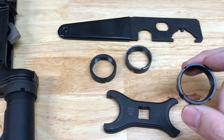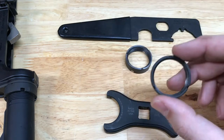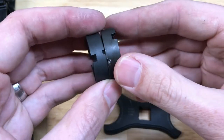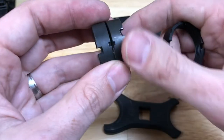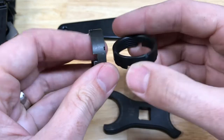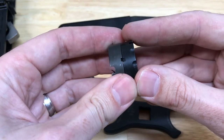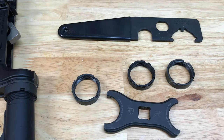They've also deepened the notches so the material can displace into them properly. If you look at how far those notches go compared to other options out there, some are cut pretty short. These castle nuts have different angles, different depths, different thicknesses — they're really not all created equal. If you imagine how much material you can displace into a deep notch versus a shallow one, that's pretty significant. If that nut backs out, you're talking about shutting the gun down.